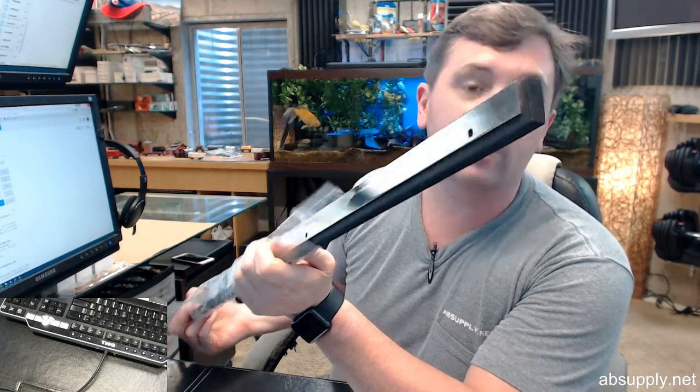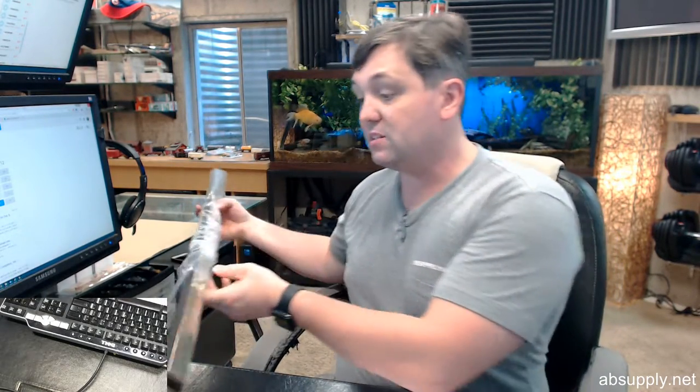Now, some people do order it unlacquered because they do literally want that aging process to start. To each his own. Now, the fact that it's solid brass or architectural bronze means it's going to be available in different finishes. If you just order the 82 BNE straight, it's going to be mill. It's going to be a streaky, flat, bronzy brass type color that is just what it looks like when it's extruded at the mill. There'd be no finish preparation to it whatsoever.